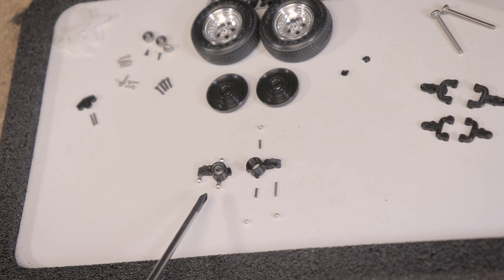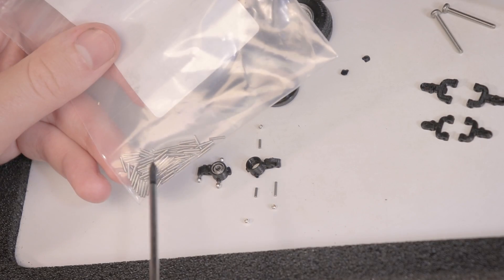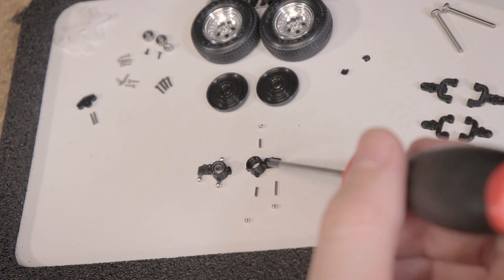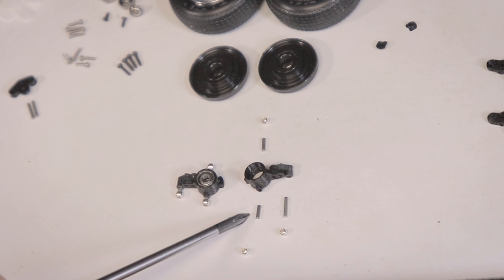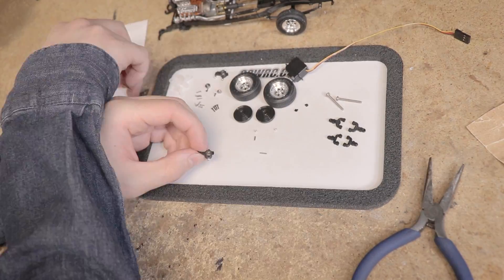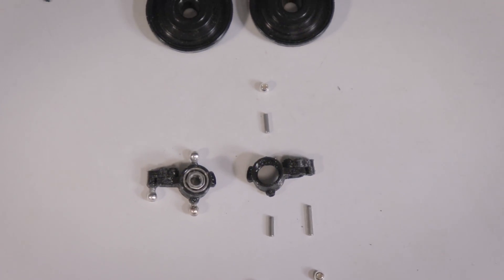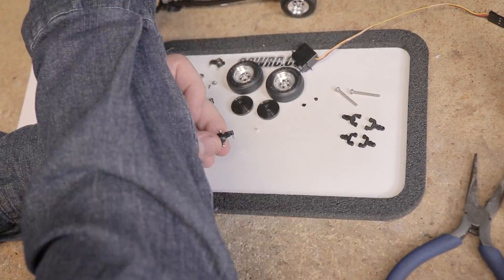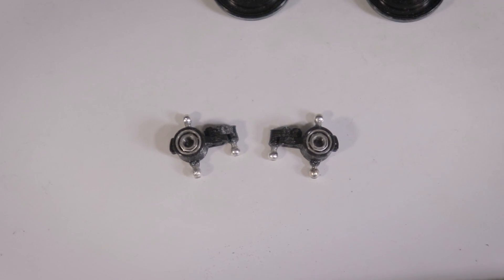I'm currently putting together the steering knuckles. The ball joints are comprised of a small steel rod and a little spherical bead with a hole through the center. You can buy packages with individually sized dowel pins — available on eBay and probably many other places. It makes the assembly process a lot easier having everything pre-cut. These are M1 by 4 and M1 by 6 dowel pins. Building your own tiny ball joints can be a little tricky, but with a good pair of needle nose pliers and some patience you can get it done. I used a bit of super glue to make sure the metal dowel pin stays secured to the 3D printed parts and that the ball stays secured to the pin.